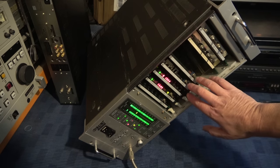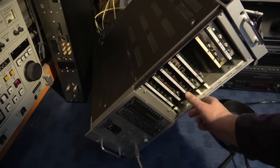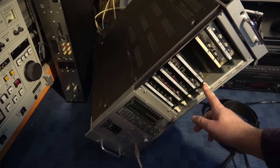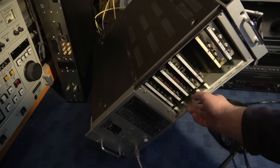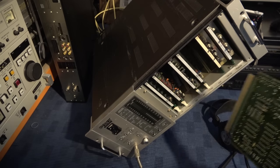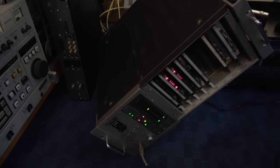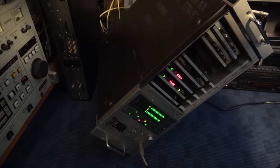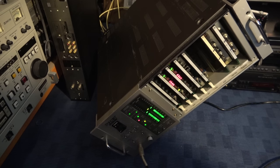Let's try switching over the decoder board. The problem is not going to be metering or the RAR card - that's optional. Decoder is the most likely suspect; the encoder is for recording, so I don't care about that. I think the decoder board is the most likely cause among these boards. Let's borrow the decoder board from the known good machine. That's working - it all appears to be working. I think that pretty much proves the fault lies in the decoder board.